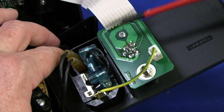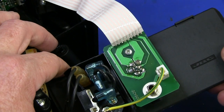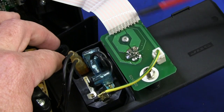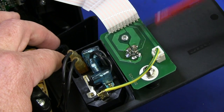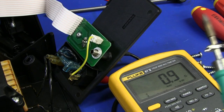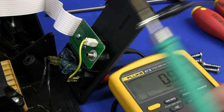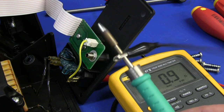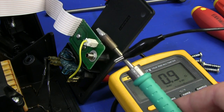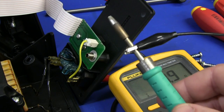It's obviously more than adequate for the job. The earth goes from the mains input directly up to the main board up there. And actually — I just measured it — the tip IS connected directly through to mains earth. So just be careful when you're soldering things. You can short stuff out if you have to solder live circuits, like replacing a battery in something like an HP 3478A. Be very careful when your circuit is mains earth referenced — you can get in big trouble.